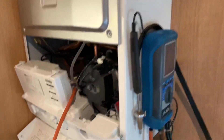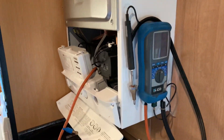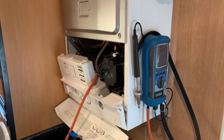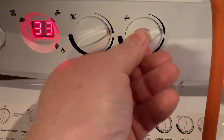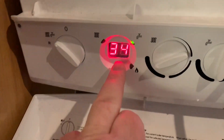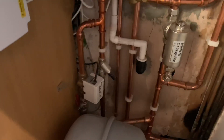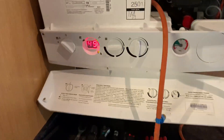As we're testing it we can print it out and show that on, for instance, low — it was a certain burner pressure — and then on high again we can print and prove that the inlet pressure is correct. To put this into service mode so we can check it on high and low, just waggle that like that. That'll go into service mode. To put it onto high, change that to there. On this one I've manually opened both zone valves so we've got a full print system.